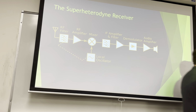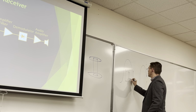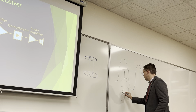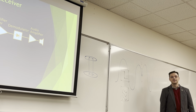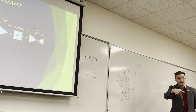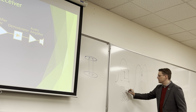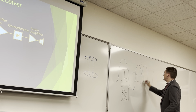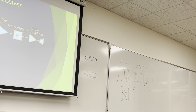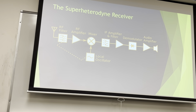Sometimes people draw, can you see if I write over here? Okay. Sometimes people do low pass, because that's what it looks like in a Bode plot, ideally, right? And sometimes people do low pass the other way. They're interchangeable. You'll see them both ways. I like the second one. The lowest one doesn't have the strike through it, so it passes, right? So a band pass would look like this, and a high pass would look like that. I like band pass and high pass. You'll see them both ways. I have my preferences. If I draw it on the board, it would probably be one of these. But when you steal images from Wikipedia, I'm not going to go in there and change this, so that's what happened. It is from Wikipedia.